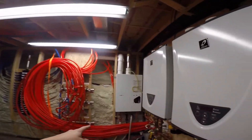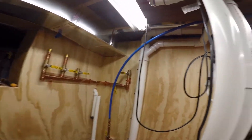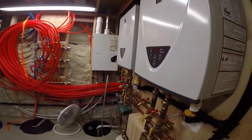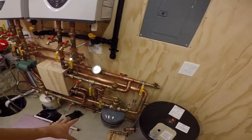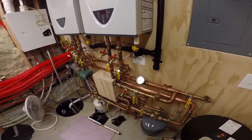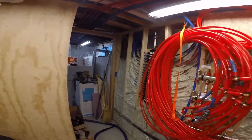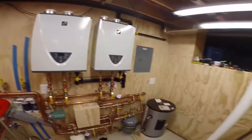In this room I will have one continuous loop of water, so it should be very pressure balanced. Everything on that manifold block should be getting good pressure from both sides. The way I have this tank set up, the hot water is also getting constant cold water pressure, so there should be no more pressure issues and no more hot water fluctuations when somebody flushes the toilet.